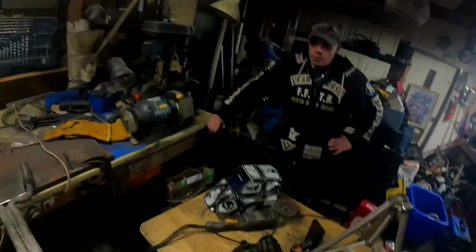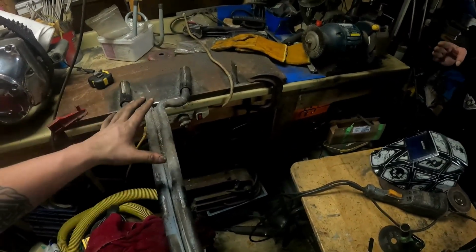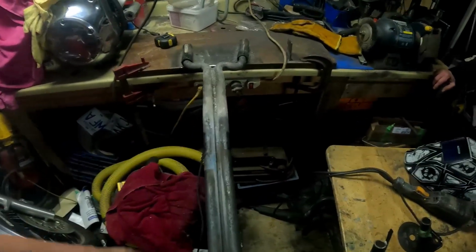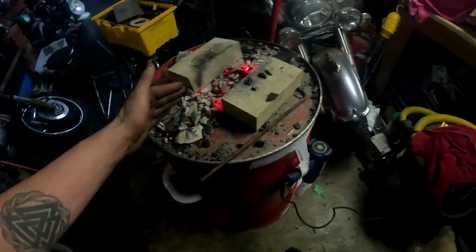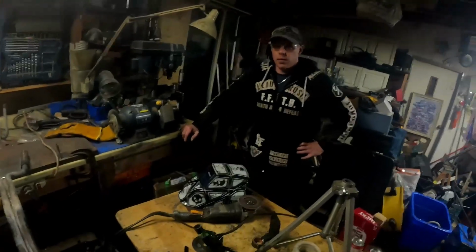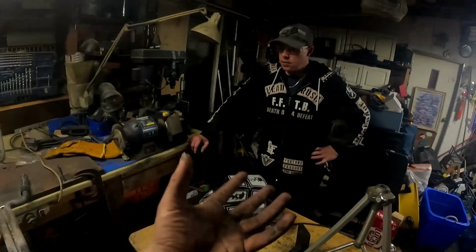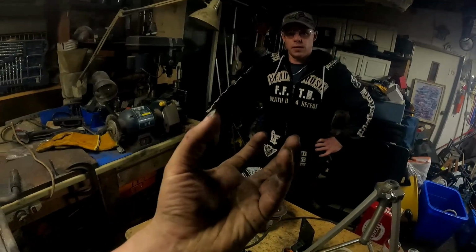So where you're heating it up right now, you're essentially only going to get a twist that's going to be yay big, right? Yeah, and then you move the heat up section by section. Gotcha. Like I said, if I had a propane forge, this whole section could have been heated up. But since I'm using a more traditional charcoal forge, which is a forge that big, it's more or less used for small tools, hatchets, stuff like that. Right. Where you're not heating up a long piece, you're heating up a thick piece, but just generally more compact.